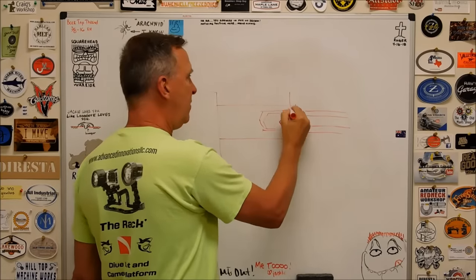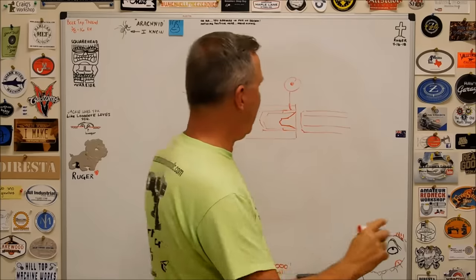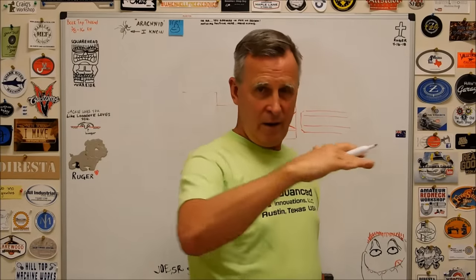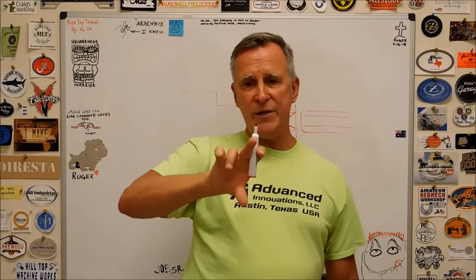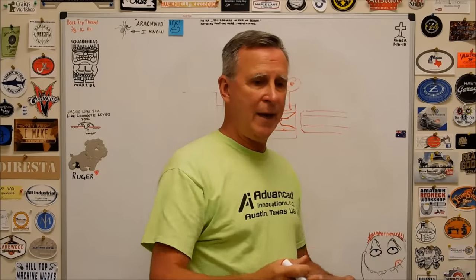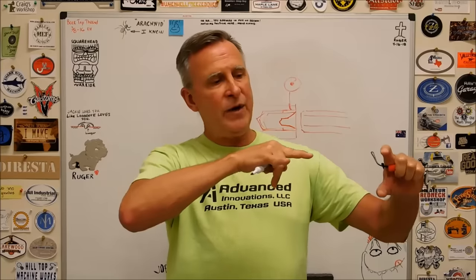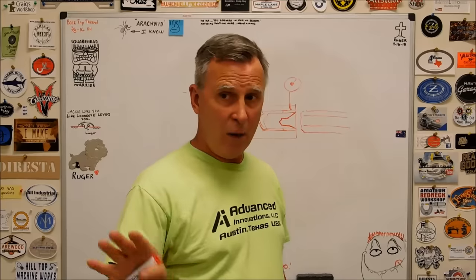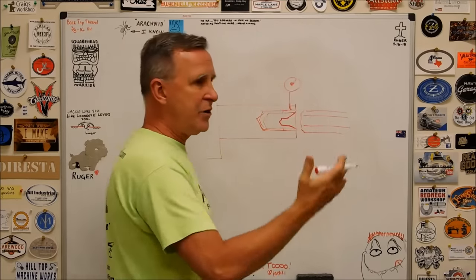the reamer is going to follow the true concentric feature formed by the boring bar, and it's going to walk in there and clean this up, and it's going to give you the square contact points that you need for your twist drill to locate at the tip and somewhere in the back at 90 degrees. That's what you're looking for. How far into that drill can you get so that the tip of the flutes at the nose of the drill are 90 degrees to the next contact point? Look at that distance on your drill, and I think you'll be shocked at how far apart some of those are. Once you have this concentric relationship, then start with the smaller drill,